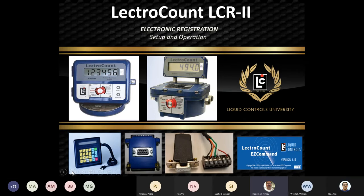So always make sure you have that in place. When you run those cables, make sure the cables are the lifeblood of the register. Without that communication between the printer and the register and most of our common applications, you're going to have an issue. So always make sure that you run those cables safely and in a way that they're protected, where they can't rub against something sharp or something hot, or something that's going to damage those cables.